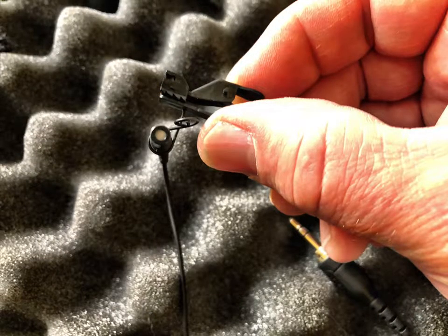To engineer the clip and the lavalier microphone, take the microphone and put it into the spring loop that comes off of that alligator clip. Press with your thumb down on that tab to open it up, slide the mic in slowly, then release the tab and it'll snug down on the thicker part of that lavalier tube. Once it's there, it's ready to be attached to the talent. There's a strain relief guide on the top of the alligator clip to put the cable through — it depends on the vulnerability of the cable, and it's up to you as the engineer.